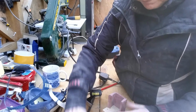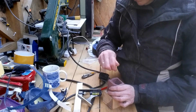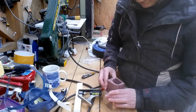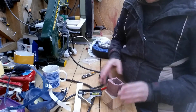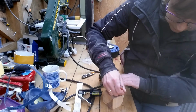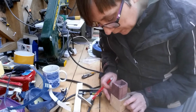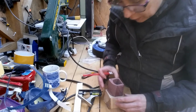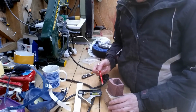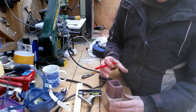And so what I'm going to do here now is move this back, sorry. Right, put this on here, put that going through that hole there because that's where it's going to be situated. Get it all lined up, and I'm just going to go around the box. So I've got a rough line, and it fits perfect at the back anyway. I've got a rough line for the cut out, because what I think I might do first is cut this out and then cut slices of about 15 mils, and that'll be ready for my two sides.